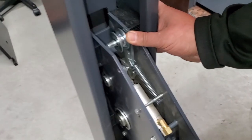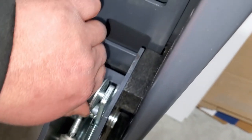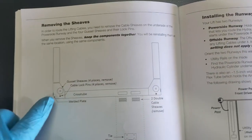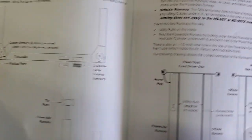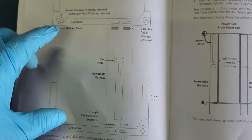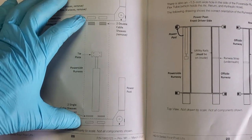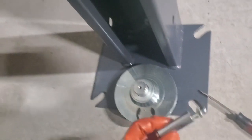You want to disengage one set of safety locks — pull up on the cross beam tube, push in on the lock and it disengages. The air locks remain in place; those are your other safety locks. Then you want to remove the sheaves out of the tubes and platforms. You can look at the instruction manual for different installation options. For our setup, the hydraulic cylinder goes on the same side where the windows are — the driver's side. Removed all the sheaves and secured the safety pins nearby for reinstall.